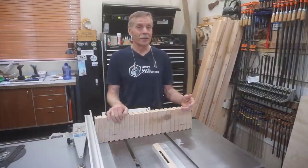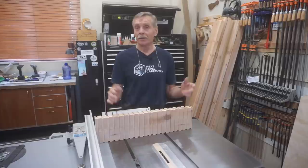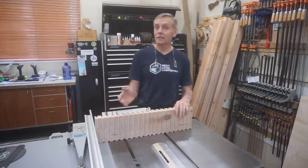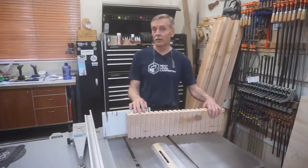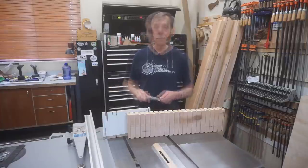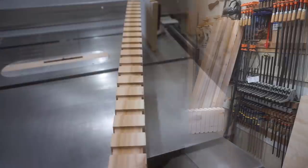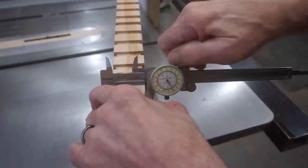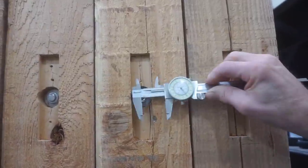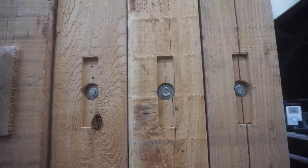Cutting all these dados is enough to make a guy hungry, but the only thing on the menu right now is humble pie — because I neglected an important step in making the setup for cutting these dados. I want a snug fit on the dados and I measured the mortise at an inch and five sixteenths. But after finishing up all these cuts I double-checked my work and lo and behold the core measurement of this blank is almost an inch and seven sixteenths — too wide for a snug fit. Instead of a snug fit I'd end up with a no-fit for the depth of these dados.